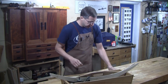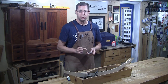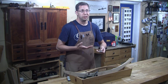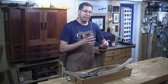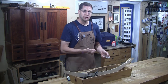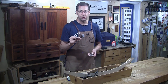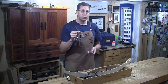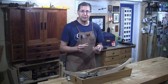Don't forget the patterns and hardware. I'm going to use silicon bronze boat builder screws — number eight, one and a quarter inch long. You need about 28 of these; pick up a couple of packs. Stainless steel or brass screws will work too. I kind of like the look of the exposed hardware, especially the bronze screws. If you want to plug the holes, make sure you have a plug cutter and matching face-grain stock. One caveat: my slats are three-eighths of an inch thick, so after countersinking there's not much room for a plug — if you're plugging, make your slats thicker.